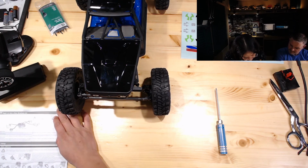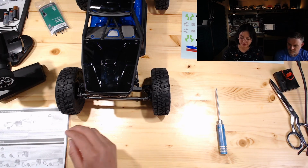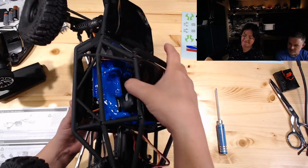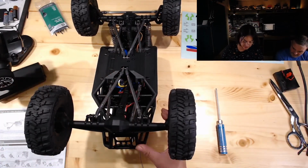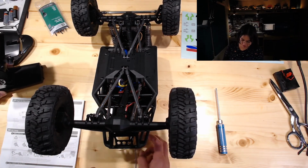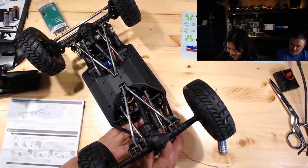Press and hold the set button. Press the on-off button. Release the set button once the LED flashes. So it might be good for you to flip it upside down or at least get it to where you can see the speed control, because there are some lights on it. I don't know the best way to see the lights, but they said there are some LEDs in it.